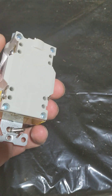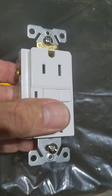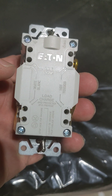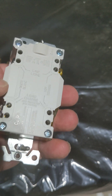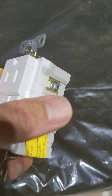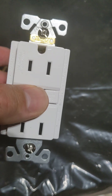If there were an additional set of wires in the box, you would separate those wires, test them to determine where the power is coming in, take those hot wires and connect them to the line side, then take the other set of wires and connect those to the load. Everything downstream of this GFCI would be protected, as well as this actual GFCI outlet itself.